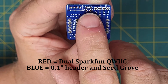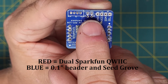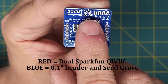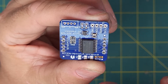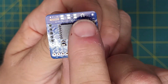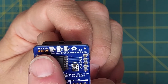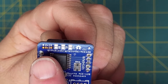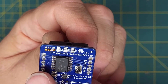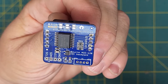Here you have positions to put your I2C pull-up resistors. Every I2C bus requires pull-up resistors on each of the two lines, and this gives you a location to put them. You can put them elsewhere in the bus if you so desire. We can also change the I2C address on the device using these solder jumpers, and the devices also come with a base address of either hex 20 or hex 38. That gives you 2 to the power of 3 — which is 8 — times 2, giving 16 different addresses, so you can have 16 of these in your project.